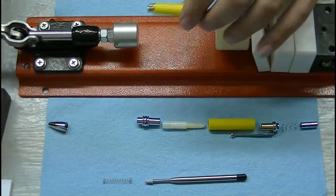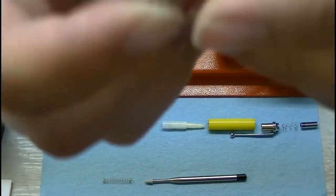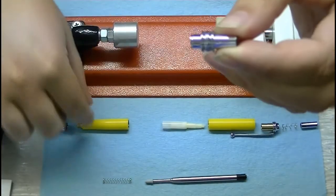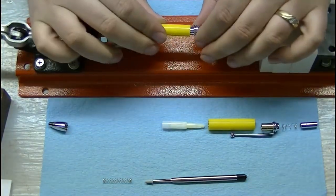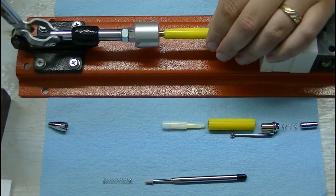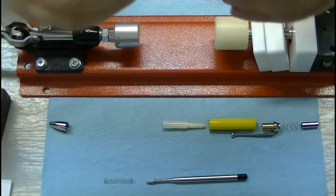Press that in, stop at the sleeve, rotate, and make sure that we have the full piece against it. Our next step: press the center band, short extension in first, into the opposite end of the barrel. We've got our center band here — this is the shorter end, this is the longer end — and we press the shorter end first into the opposite end of our lower barrel. Rotate, press in a little further — there we go, we got a good fit on our center band.